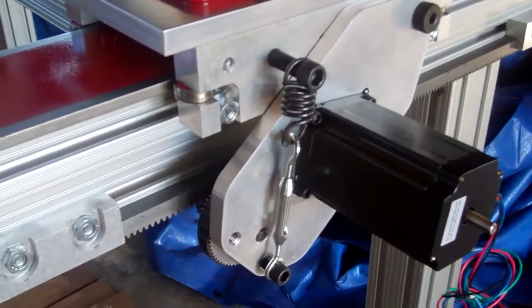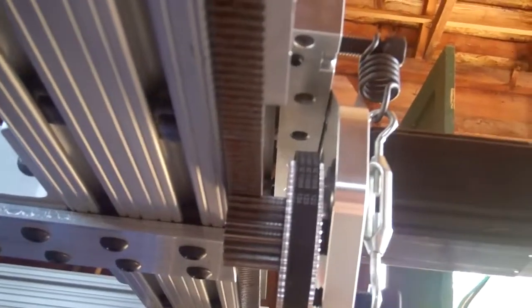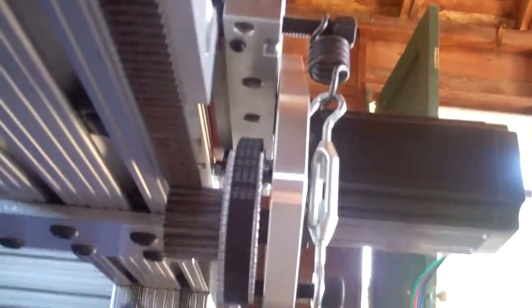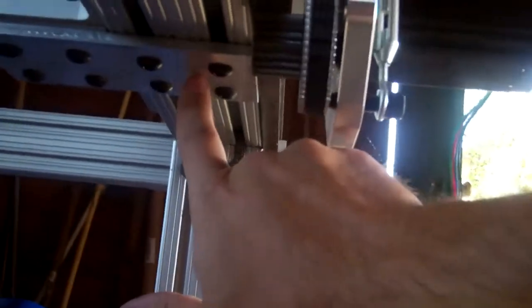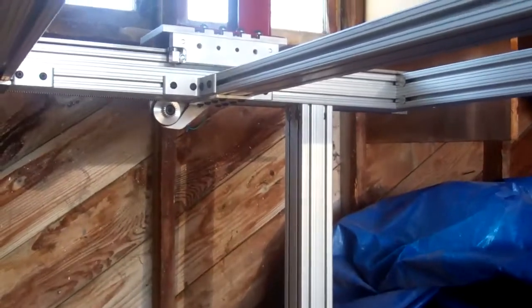There are a few little things that are kind of weird about this. I'm going to have to ask the guys at CNC Router Parts what they say, because if you look here, kind of in the default position, the end of that gear comes right up against the face of the rack, which is mounted right up against the rail. So when it slides back over it, it's kind of hard to push with your hand. Things are kind of misaligned — that's another problem. I'm worried about it rubbing against the plates here that I recently had to add, and also the legs. So there's a little bit of troubleshooting to do there. It was very hard to push, and down here at this position there's something rubbing on the far side that I need to fix.